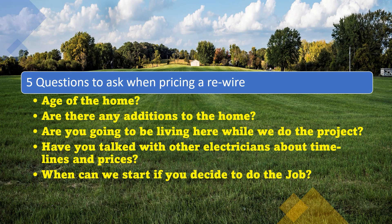The next question: are you going to be living here while we do the project? I have to charge more money if they're going to be living there during the rewire, and the reason is simple — it just takes longer. Every day I have to wrap everything up, clean up like we weren't there, and get power back on to the respective areas every single day. Never leave someone without power more than just overnight. I try to make it seamless — if I kill a set of lights, I've got them ready to tie back in; if I'm killing the refrigerator, I've already got it stubbed up through the floor to come back on every day. That just adds time and more time management to the project.